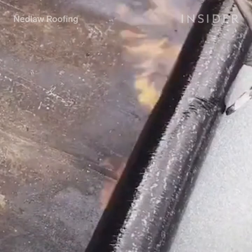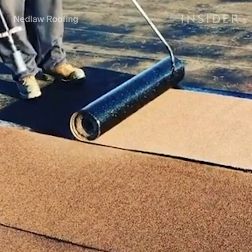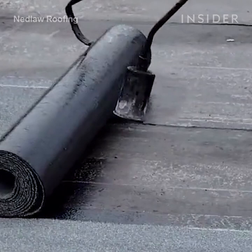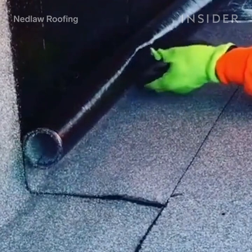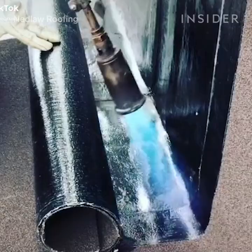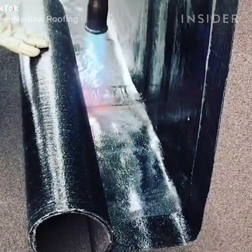The asphalt is usually around 500 degrees Fahrenheit. The torch is 2,000 degrees Fahrenheit. We want to protect the roof so that we don't start any fires and that we're as safe as possible. We use things like a cover board to protect the insulation and anything below from fire, as well as special tape installed around the perimeter to block fire from getting inside the building.